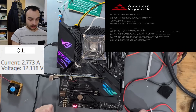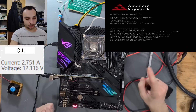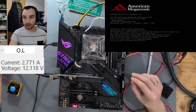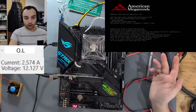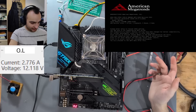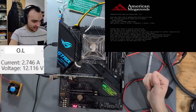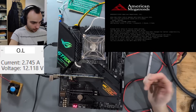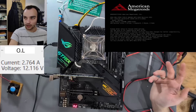I'm going to leave it at that because I'm currently not able to replace sockets, so this board can be used as it is right now, just without the two B-channel RAM slots. One of the two missing signals can be replenished by bending a pin back, but the other one we can't because it's broken off. I'm putting this to the side for now. This board is definitely worth sending out for socket replacement because everything else turned on fine without any problems.